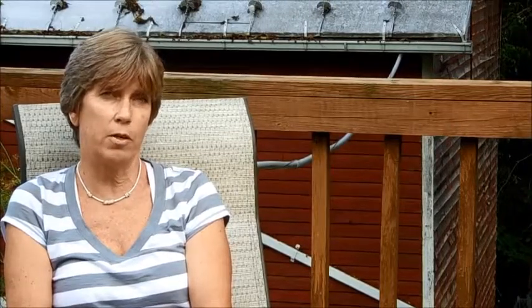There are a number of safety considerations, especially when dealing with Fresnel lenses. The focal spot can reach extraordinary temperatures, like 2,000 degrees, so you have to be very careful not to have flammable items at the focal spot. This device doesn't work at the focus — we work several inches in from that, so temperatures aren't nearly that intense. But in general, if working at the focus, you must be very careful of where that spot falls during the course of the day and year, wear eye protection, and keep flammable materials out of the region.